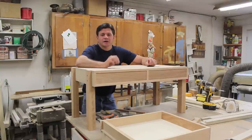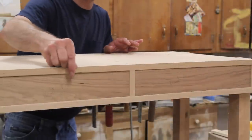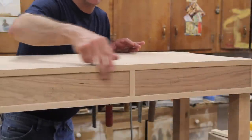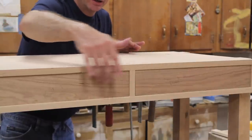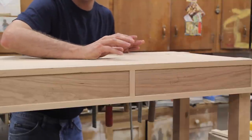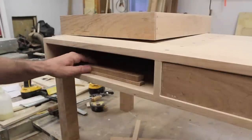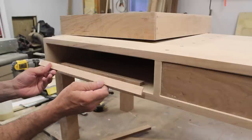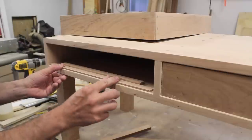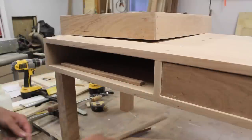Before I get started, I thought it would be good to show you some of the things I did that you might find interesting. The first thing I wanted to point out is if you look at the back of the cabinet, you can see that the piece of wood is the same — it's cut in half, and that makes up the back of the cabinet. Because the grain follows through, it's just a nice attention to detail. For the drawer stops, I glued a piece of cherry, and to find out the depth of the drawer stop, I took a cut-off from the same material, held it on the cabinet, drew a line, and then clamped this piece of cherry at that line.